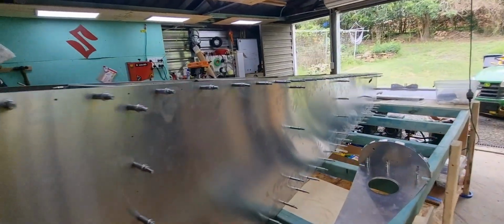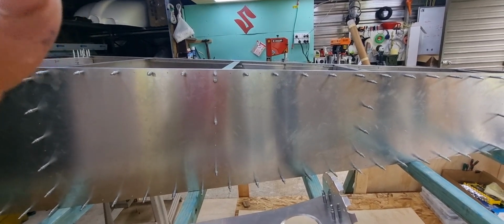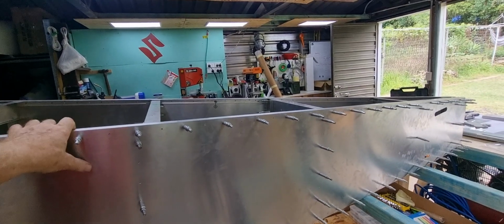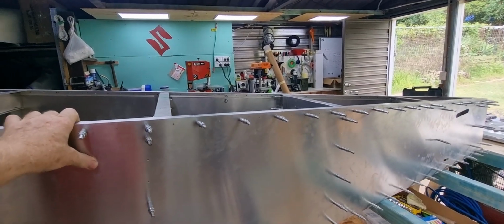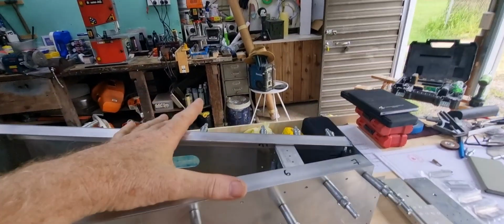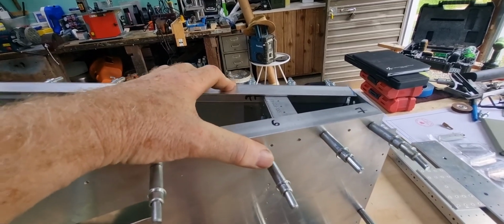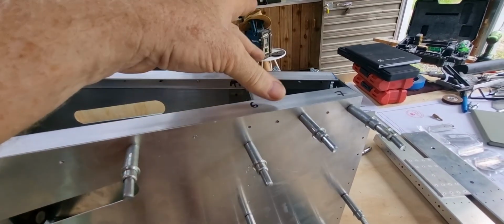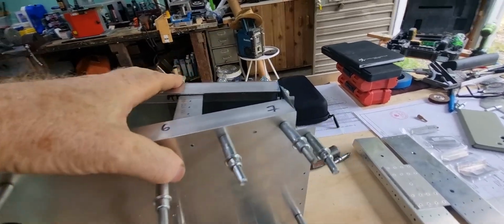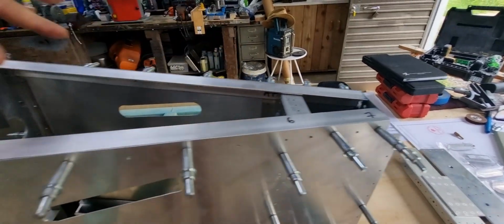At some stage you're probably going to have to commit to one way, but what I mean is that once I shoot the laser level down the longitudinal length of the tail cone, I want to ensure that these sides are both plumb, and I take this sort of moment out of it. You might just see that really twisting like that. That is to ensure that I've got this plumb true. You'll even see how much that last rib moves before I even commit to doing these.